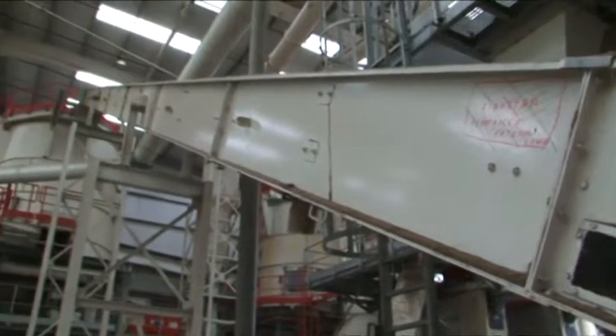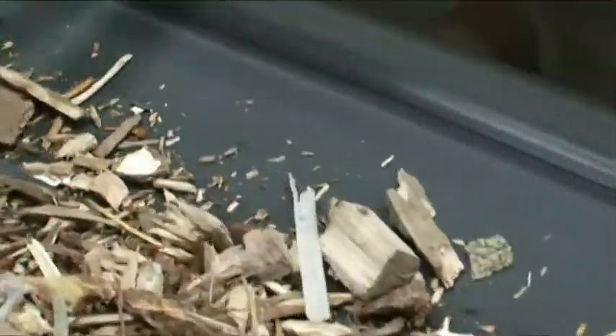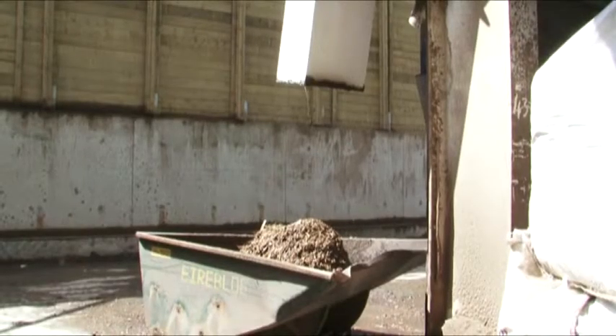The oversized material is taken out on a conveyor into a water bath. The principle of the water bath is that heavy material like stones and pieces of metal fall to the bottom and are conveyed to a chipper, which reduces that to under 50mm. So your three streams of wood have now been cleaned completely.